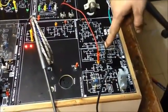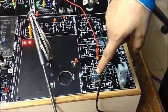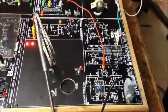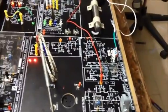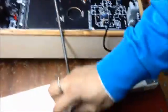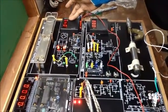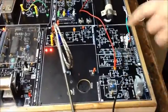One is for zero setting and one is for span setting. The holes are provided on the top so that you can adjust it with respect to your requirement. Now, first we will place a 50 gram load on the sensor and we will observe that it is coming 49, that is approximate, which can also be adjusted through this port.